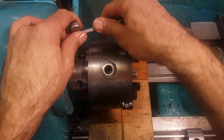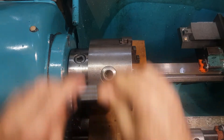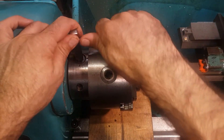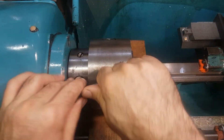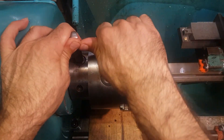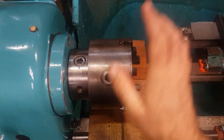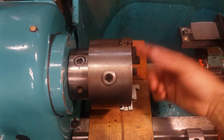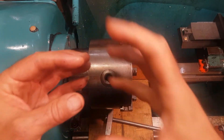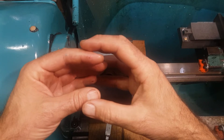I'm doing it the tightest I can with four fingers. I go around again to check all the cams - I should not feel any movement anymore. No movement, no movement, and no movement. If I were to put a dial indicator on here, I would get the least amount of runout, because I know the two mating tapers are concentric to each other, because I gradually tightened the cams up.